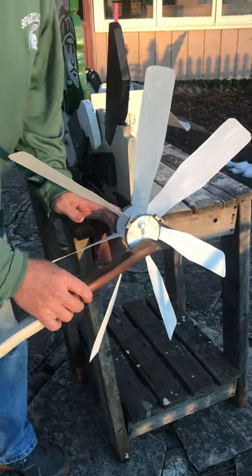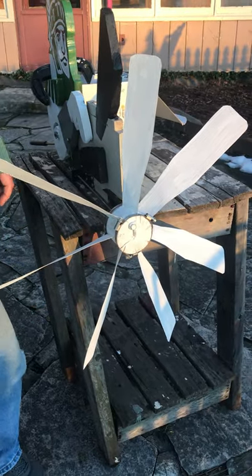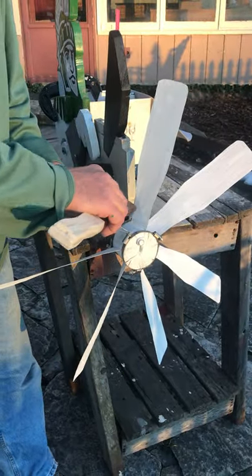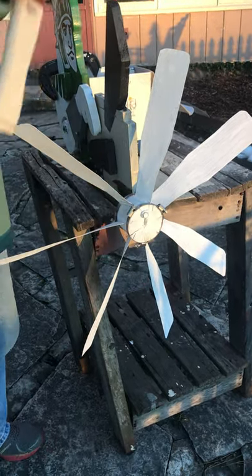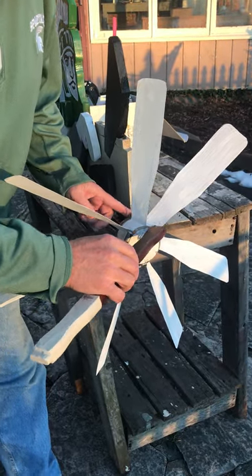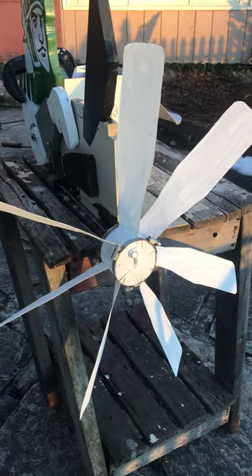The way I built it starts with a limb that fell out of a tree — it's maple and it was round. A section about three inches long was cut off and it has slots cut at an angle: seven slots that the blades fit into. Each blade has a T-shape on the bottom that slides down into a slot, and there are six small clamps daisy-chained together that when tightened hold the T into each slot so the blades are retained nice and tight.